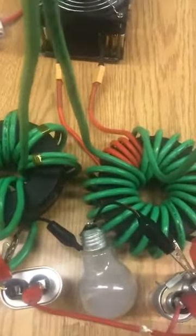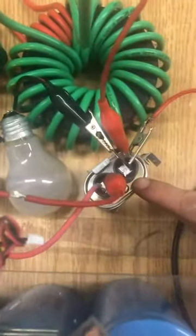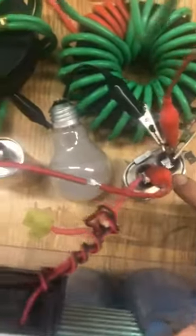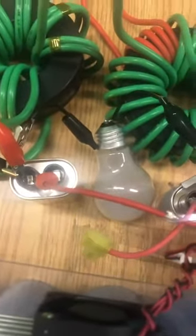Being switched at a crazy speed. Then I have two just-under-one-microfarad capacitors each — I think one's at 0.95 and the other one's at 0.82 — so just under 0.5 of a microfarad combined.